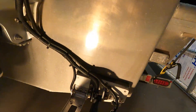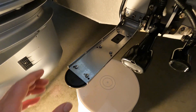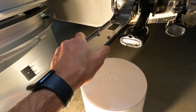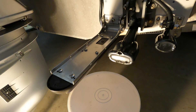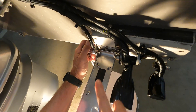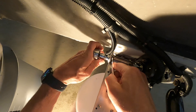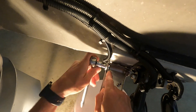This is a Lowrance AI 3-in-1 transducer that I'm going to calibrate today. A couple of 10-millimeter bolts pop it out, and I'll put it in a bucket of water. Because I have my angle set correctly, I make a mark here so that when I reassemble it I can get it back to the perfect angle just by matching up the red paint lines.